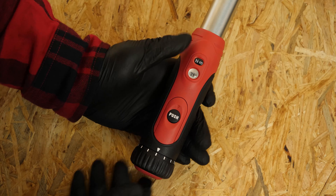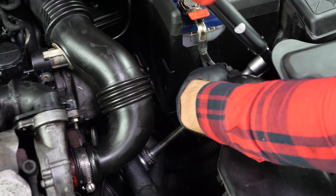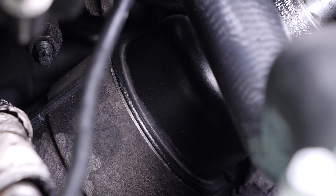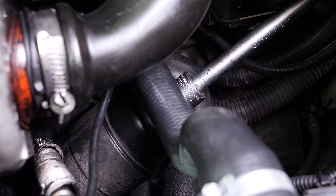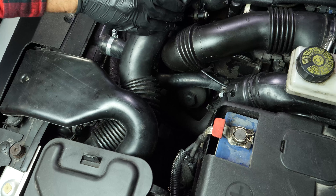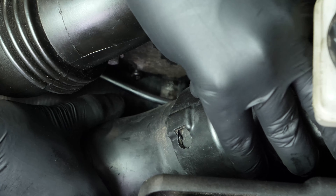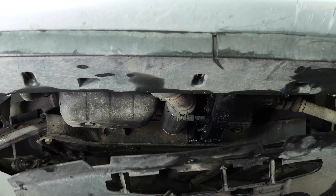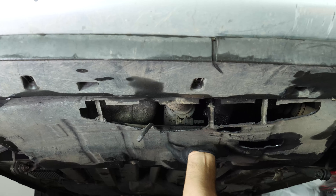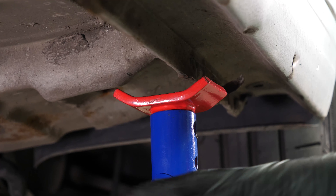Be careful — with this kind of oil filter, the new joints can be excessively thick, making the actual tightening process more complicated. As a result, you have to ensure that the flange washer is flat against the metal engine frame. Don't force it too much, as the part is fragile. Place the air inlet conduit back. Now you have to put the oil back into the motor — you have to be very careful and precise when doing this part of the job. Firstly, put the crankcase back in place.